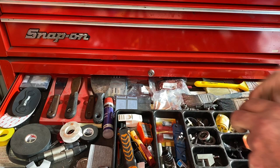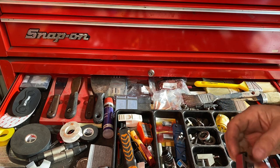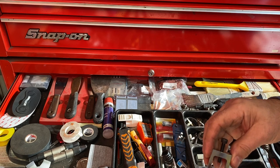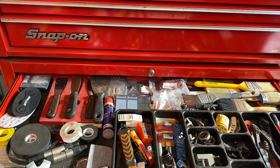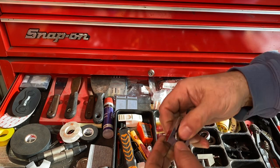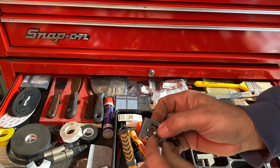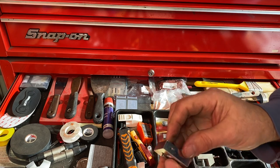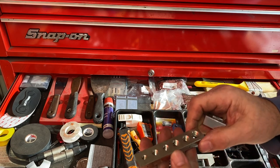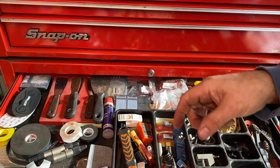This here is for wire lock. So if you need to drill a hole, you put your nut in here and tighten it down — let me get a nut as an example. You put the nut in like this, cinch it down like so, tighten it down like that. Now you drill there and it goes through the housing, or through the material, and out the other side — so now it's two different sizes. The same thing you can do with a bolt too — screw the bolt in here through there, drill the hole right through the bolt, and now you can wire lock a nut and a bolt so it doesn't come off. Neat little thing.